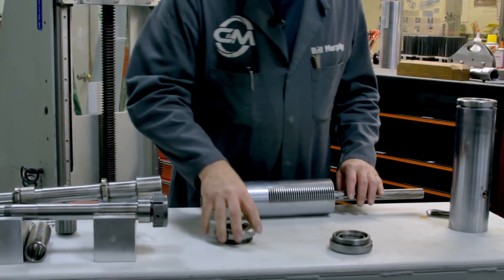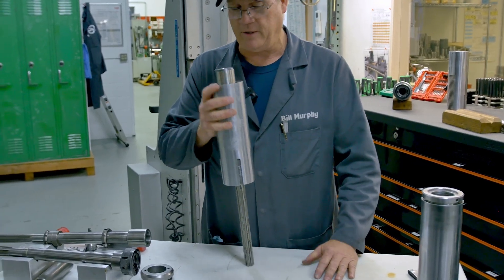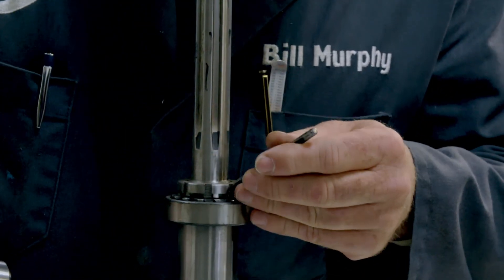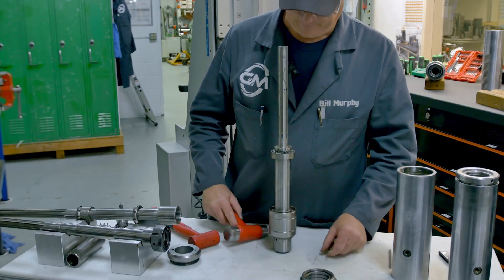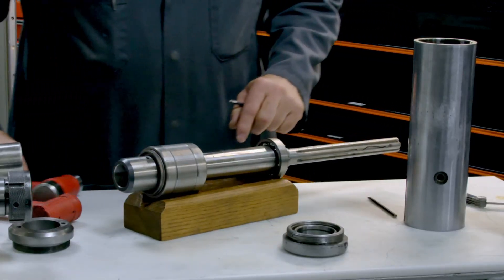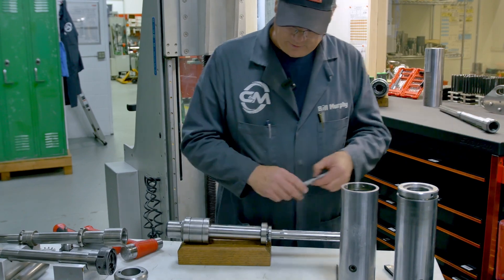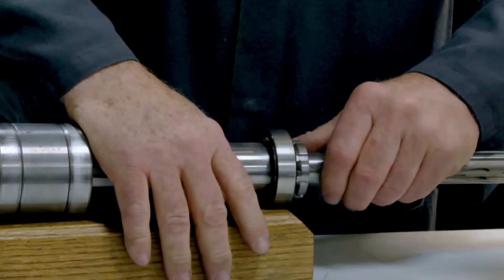For this demonstration we're going to take the Bridgeport apart using jouncing. I've got a UHMW pad here. So up on top we've got a nut — usually doesn't take much to get them out unless they're really in there tight. This is an AN-06 nut. This one has a lot more castellations to it so you know it's a better precision nut; the other ones have four. We just want to loosen that up and spin it off.